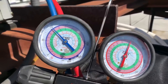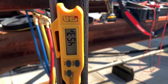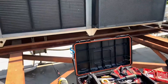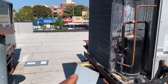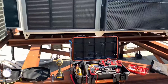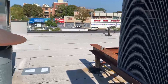Let's say we were at 30 degrees saturated and only 35 degrees at the evaporator outlet — that would be only 5 degrees of superheat. Five degrees is low. That would be indicative of low airflow: clogged filters, loose belt, defective fan motor, closed air damper, or a dirty evaporator coil. The system could also be overcharged, but typically it's one of those airflow-related causes.